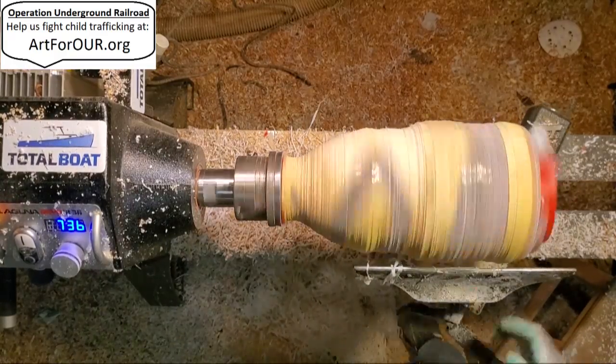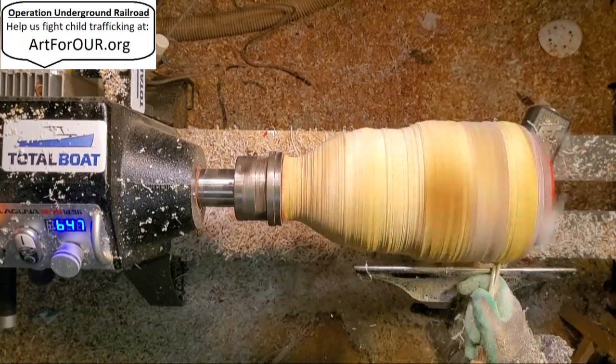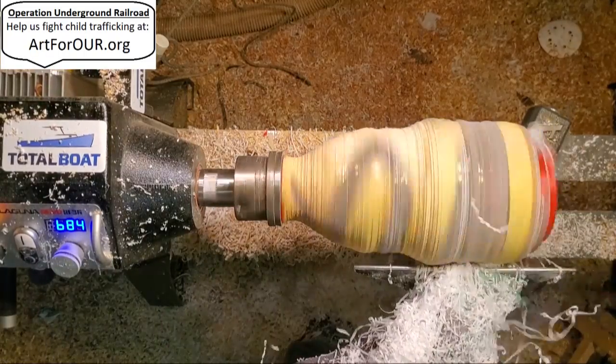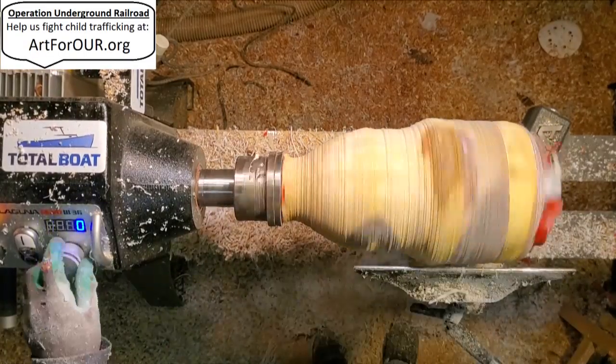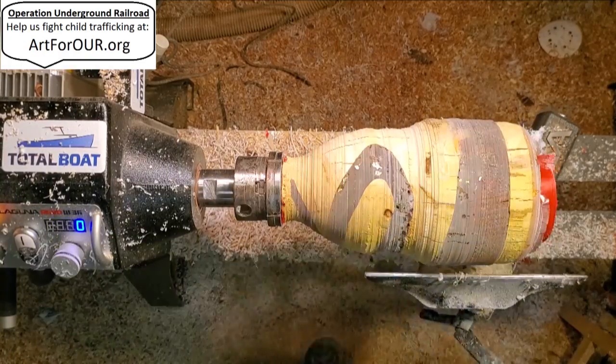So I don't think it was the epoxy's fault, because you can see areas of it that are totally clear, but you can see bubbles coming straight out of the wood. So I'm gonna have to find a way to seal my wood before I do my next one, and I'm gonna throw in the pressure pot for good measure. I've had good luck with that in the past.